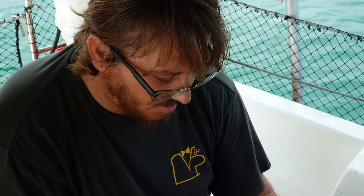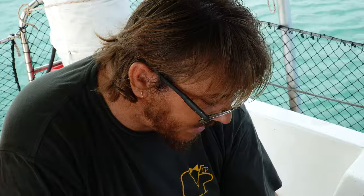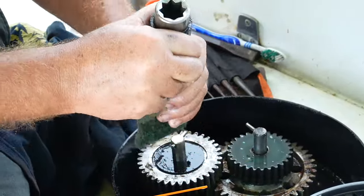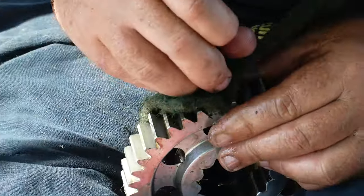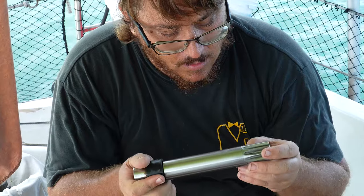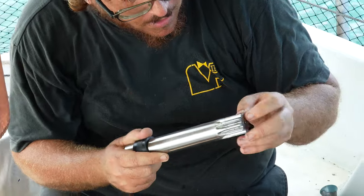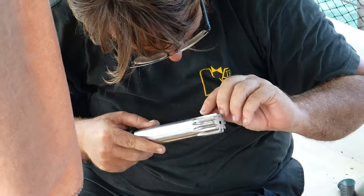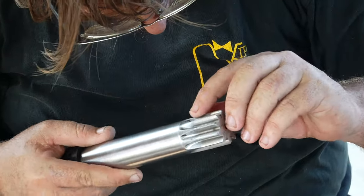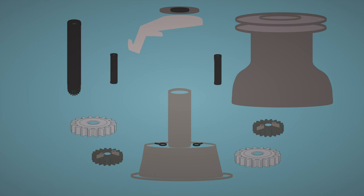I'm looking if there's any burring or just general wear and tear, but there seems to be no wearing. Yeah, these winches have been on the boat since it was built. You don't think they look like they're in bad shape? No, not at all. I don't feel any. Without any electronic or scientific instruments? Yep, there's almost no wear on any of the parts or on the gear. I can see a little bit of wear on the gear, where it's some work use, but no significant. And then finally the pawls with their tiny springs inside that have to be carefully taken apart.